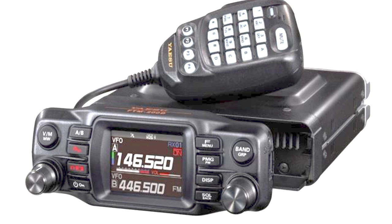I should also add that apart from analogue operation, it also has on board the Yaesu digital modes. The radio also has the ability to memorize customized functions that you commonly use, and you can store up to eight of these function sets. It also has a wide frequency range on the receive side — it goes from 108 MHz to 999 MHz, so it misses out the FM broadcast band. Although it doesn't actually specify it, I'm assuming it does cover the AM aircraft band, but you will need to check this as it's not mentioned in the provisional information.